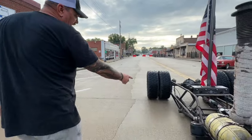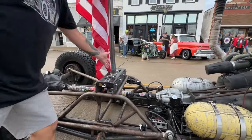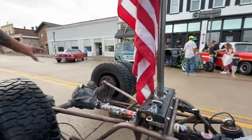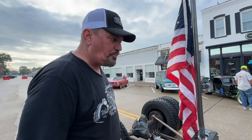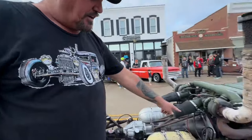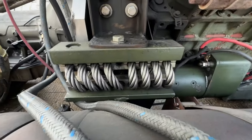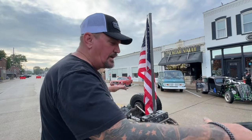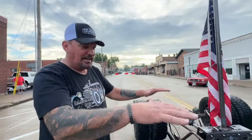And it's really neat because the trunnion bearings are here. So this is where all the weight is. Instead of having all the weight over the axle like you would normally have, it's actually back here where the cantilever airbag system is. Another interesting fact, if you look here, see these coils? They're actually engine mounts now, but this engine's designed to be dropped out of the back of an airplane. It comes in a big aluminum crate, and these work like shock absorbers, so when it hits the ground, it basically allows it to come up.